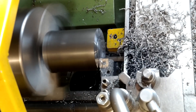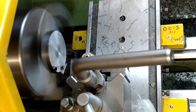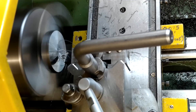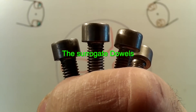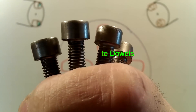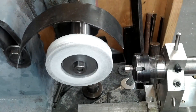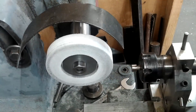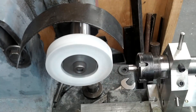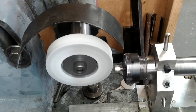This next bit of material was even harder, and after losing the battle with the bandsaw it too was faced on both sides. I hadn't got any rollers about 10mm diameter, so I decided instead to use high-tensile style cap head bolts. By grinding all the heads to 12mm diameter, I should be able to tap the end of the shafts and use these as surrogate rollers — after all, they don't spin.